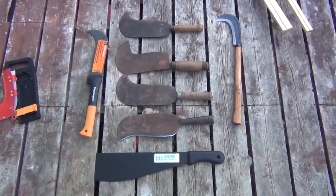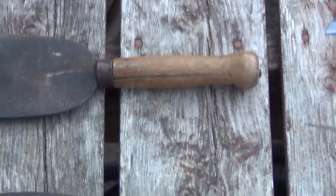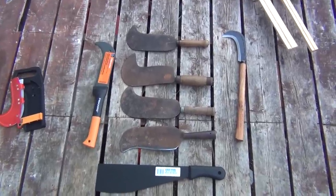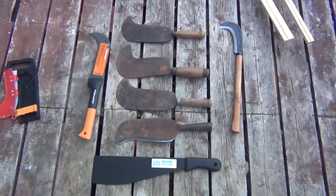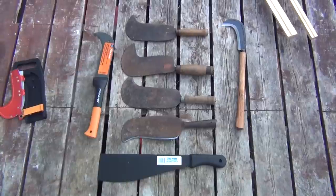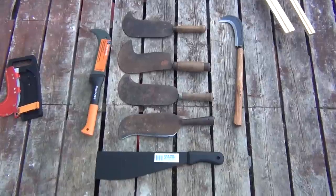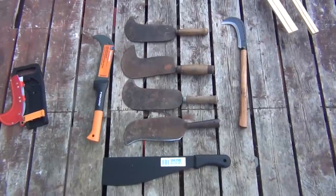I've got to do a little bit of work before I start using them. I'm going to put some expanding epoxy in here to fill that in. All the blades need new bevels on them — none of them are sharp, and some of the edges are damaged, but that's not going to take very long because the steel is probably spring tempered, somewhere around 45 Rockwell. I doubt it's any more than 50 Rockwell if it reaches that, because these were made to be extremely tough agricultural tools. Really looking forward to working with these.